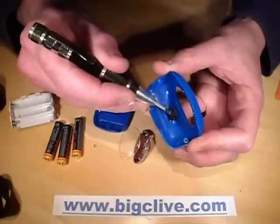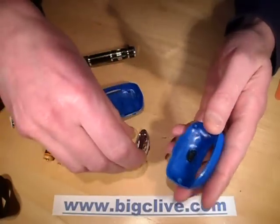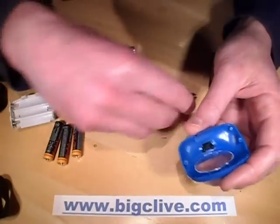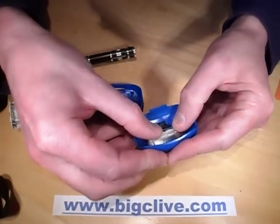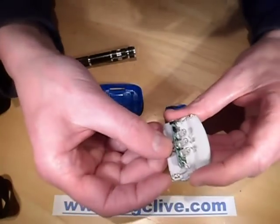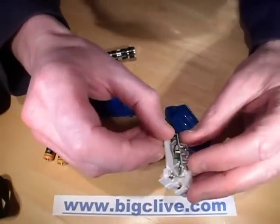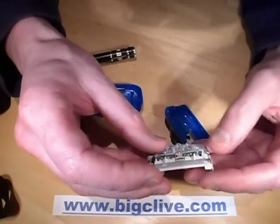Noting the switch can go in two ways round but the back of it is slightly higher, so you'd have to note that if you took one to bits. The lens actually falls out in exactly the same way as the Petzl Tica — it's very Petzl Tica really. I assume Petzl were the first to come out with this and they just didn't rebadge someone else's product. The original Petzl Tica had this sort of assembly but there was no circuit board in it at all. Instead of a click on/click off button they had a slide switch, but it wasn't actually a switch — when you slid the little plastic insert it pushed a metal strip against a resistor lead. The LEDs were held in just by pushing them through a little support and then folding leads along the back and wedging it in from the side. It was really bad construction.